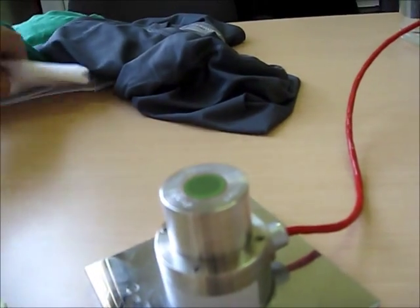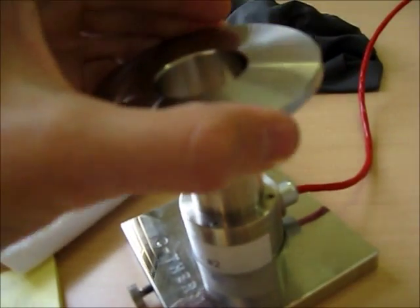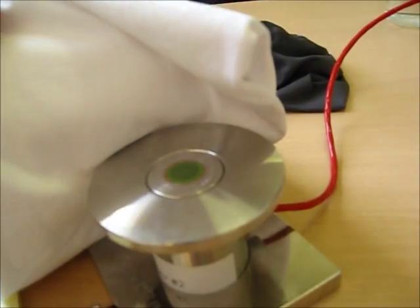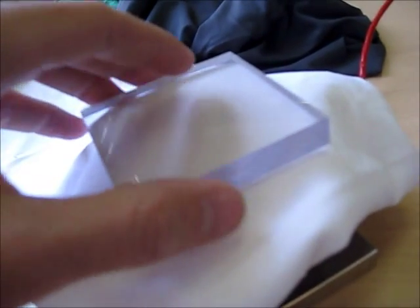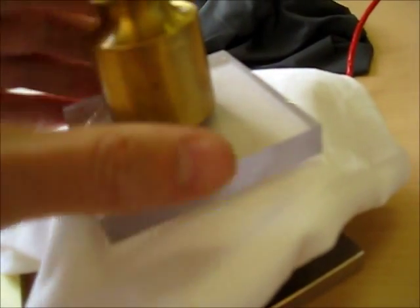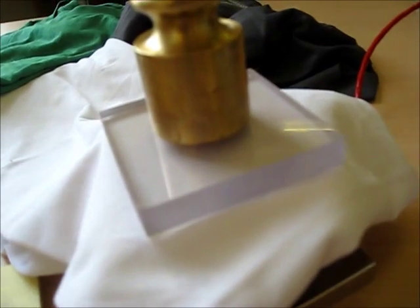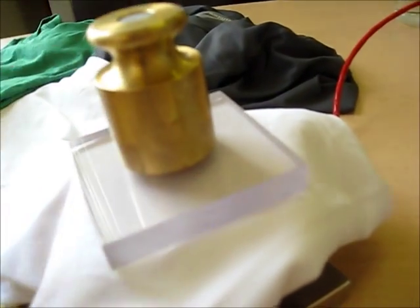To test the sample we're simply going to place it on the active area of the sensor which you see here, and I'm going to use the extension plate here just so we have a little bit more room in terms of placement of that sample. We want to make sure that we fully cover this active green area of the sensor — so we've got good coverage there. To ensure a good equal distribution and compression of the sample we are going to place a piece of glass here and then our standard weight. The weight is there to ensure that we get a good contact with the sensor itself. We don't want to just put the weight on because it would cause too much localized compressibility of the material — the cotton is very compressible — so we want to displace that weight over the full surface area for consistency.